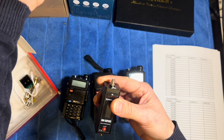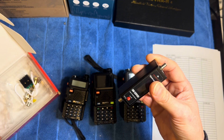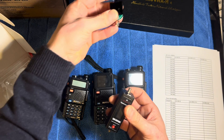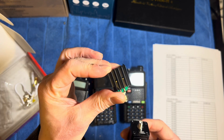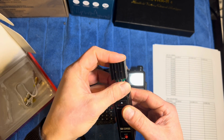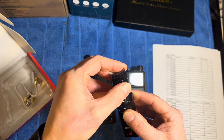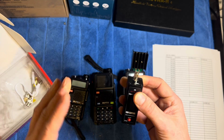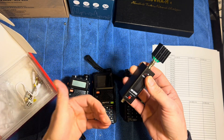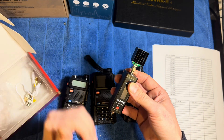We're not putting an antenna on the end of the meter because antennas can suck power and reflect power. What you want is something that simulates a perfect antenna. For that purpose we have a dummy load — a 50 ohm dummy load. By attaching this to the end of the meter it will replicate having a perfectly matched antenna across all of the bands we're testing, so nothing gives us significant losses. It's radio, meter, then straight into the dummy load.